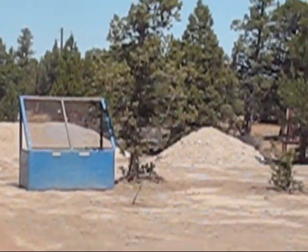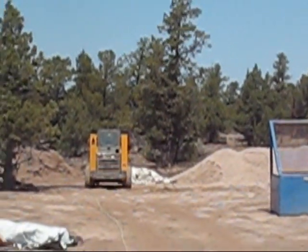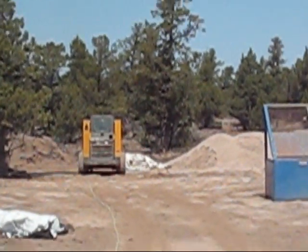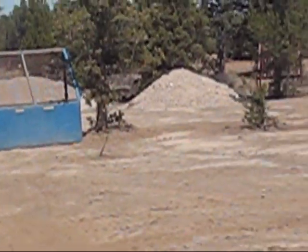In front of him is actually cement. I couldn't get any of the asphalt emulsifier, so we're using Portland cement as our stabilizer for the bricks. It should help waterproof them a little bit.